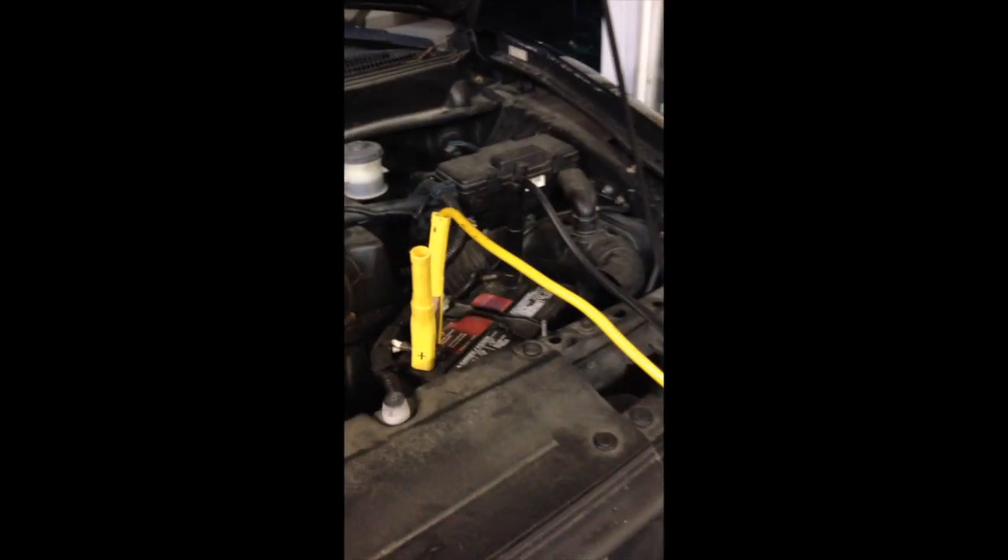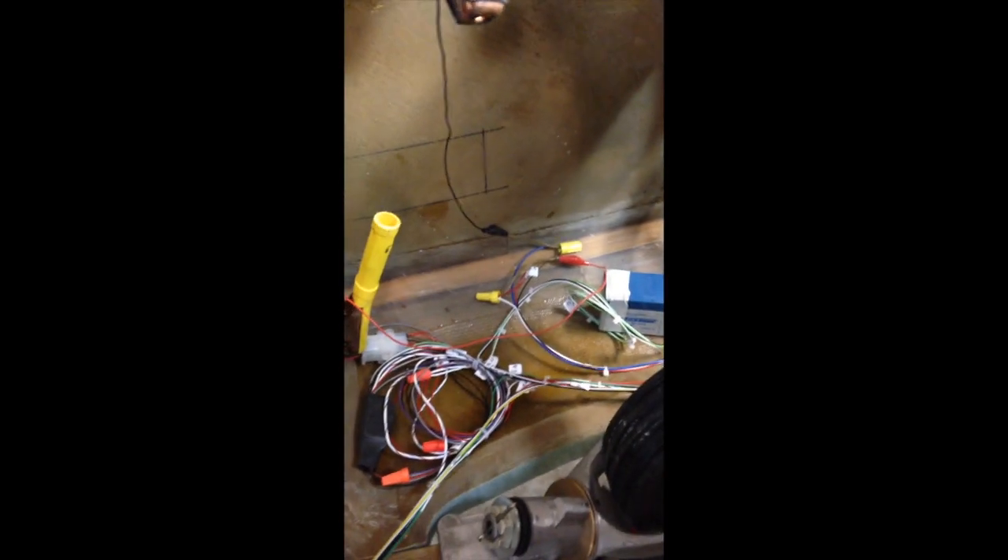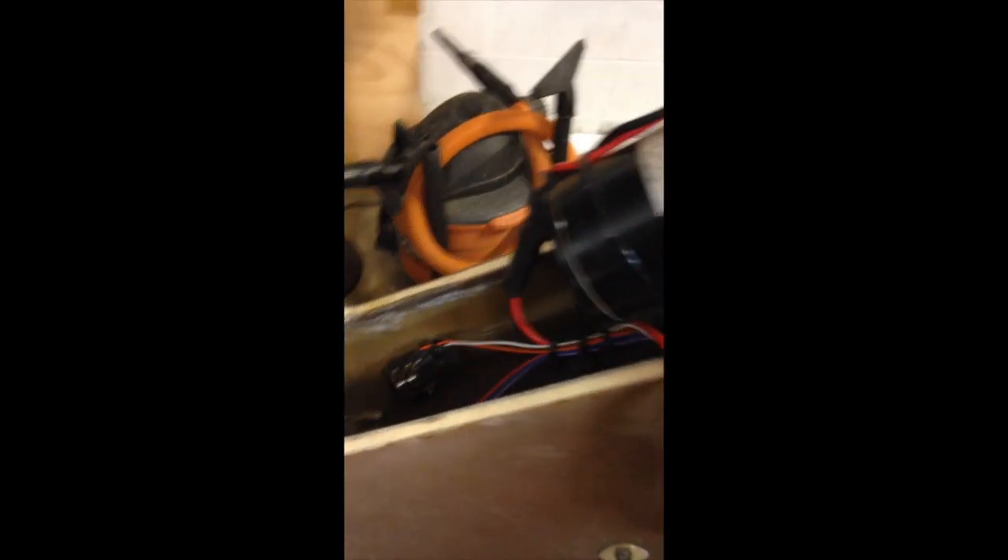I have finalized the location of NG3 and NG4. They actually drilled and bolted together and it should work out all right. We're going to cycle the gear one time and show you how things look. The jumper cables are connected to the rat's nest over there. Plus and minus are going to the proper leads, so everything is connected. You can see NG3 and NG4 right there bolted together and attached to the actuator.